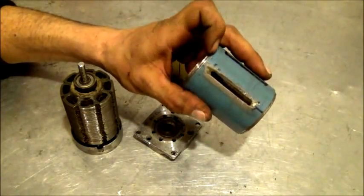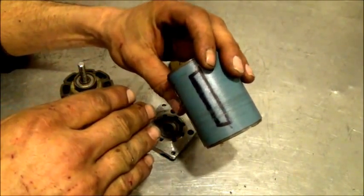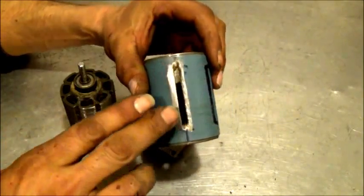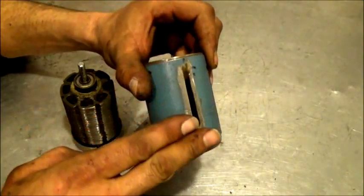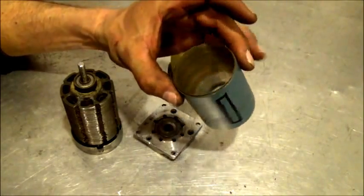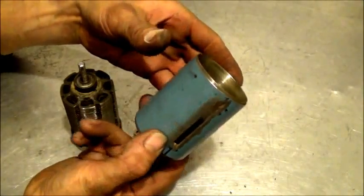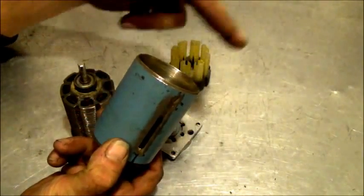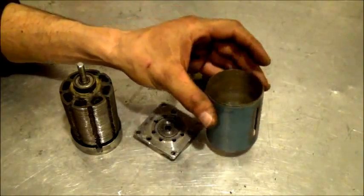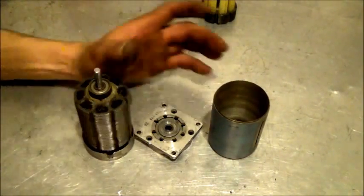I've made a slice all the way down the case with a thin grinder blade, then angled the grinder blade to give me one side that's angled with the turbine direction and the other side a blunt edge. It's always going to spin in one direction — I don't need multi-directional on these, they're just test turbines. We now need to build an outer case around this that's going to get the air or water flowing in a vortex direction, spinning it into that case and delivering that force into our Tesla turbine.